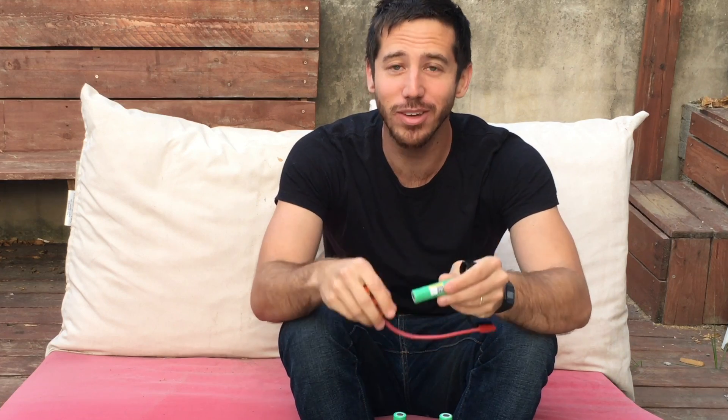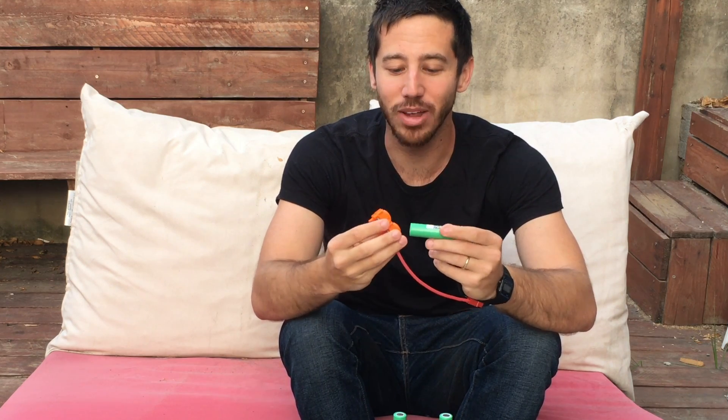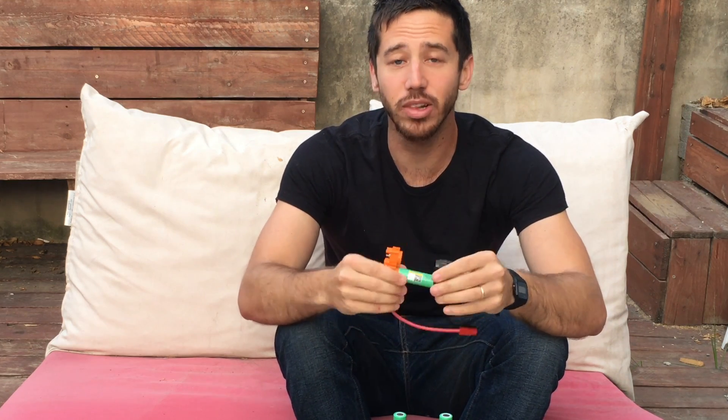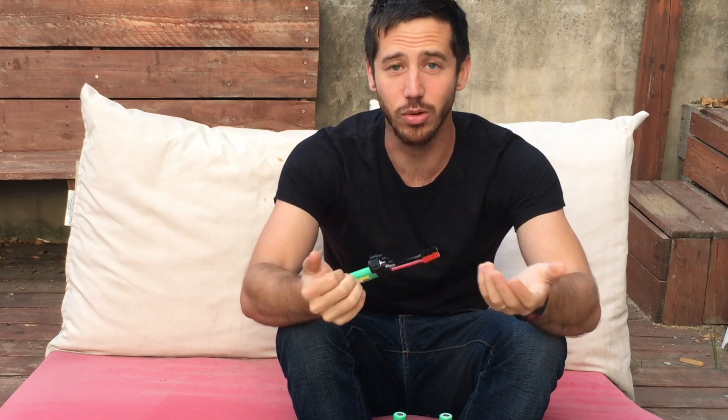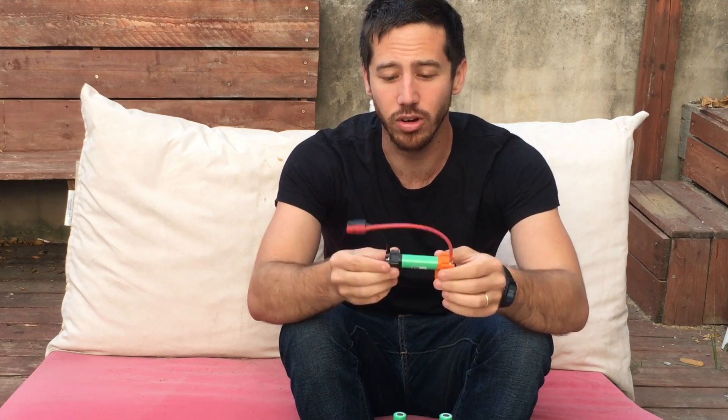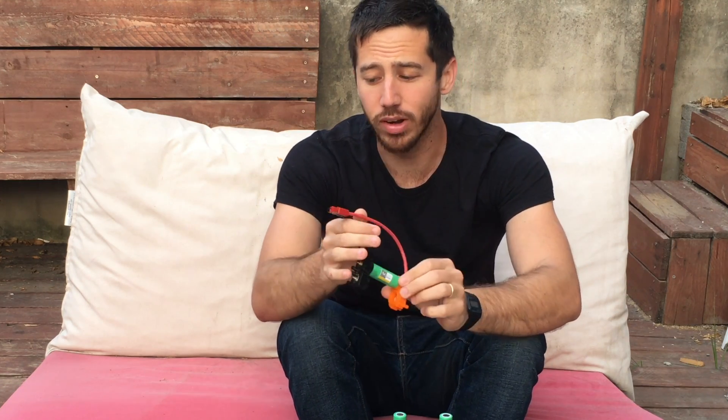To answer the most common question I've been getting — when are the V2 caps going to be available for purchase? — I have a date: this coming Tuesday, April 17th, four days from now if I get this video up on Friday. These are rated for 20 amps each continuous, and can do even more than that in pulses, which is plenty for testing these Samsung 25R cells, which are also rated for 20 amps continuous.